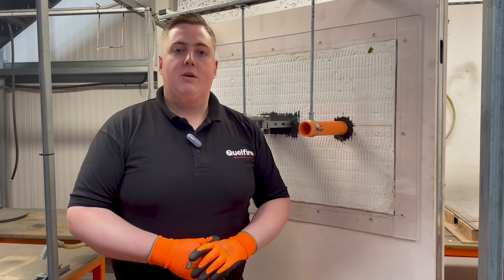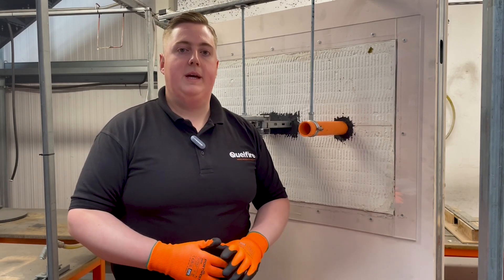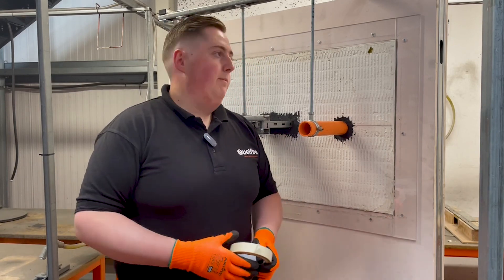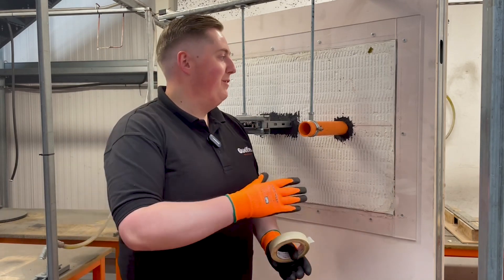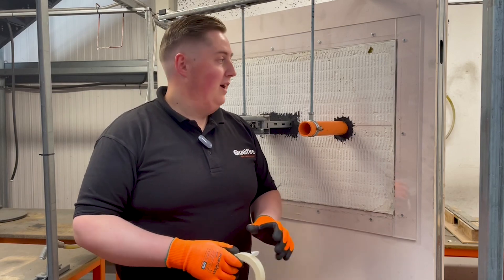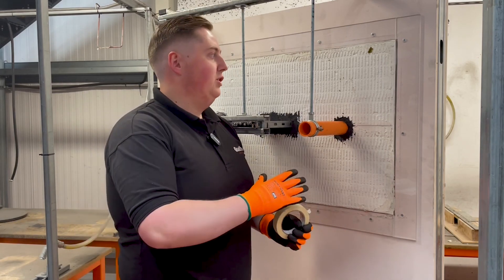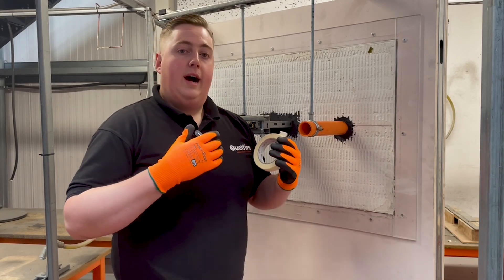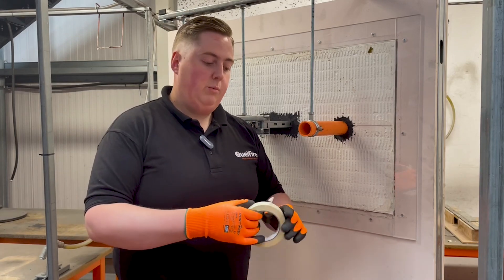In this video we're going to briefly show you a demonstration of installing the Quellstop ablative coating. On this demonstration wall behind me we've got a double bat seal installed — it's just one we had a bit of a practice on, so it's certainly not a model installation, but essentially this is what you'd be looking at on site. So you've installed your double bat, installed all the closure devices around various services, and then you'd be looking to neaten up the seal and paint over the face of it with the Quellstop coating.